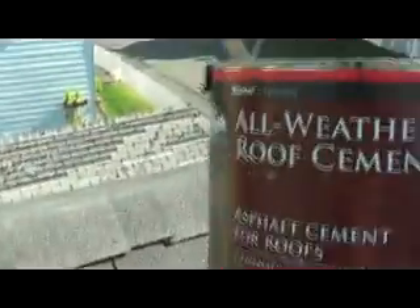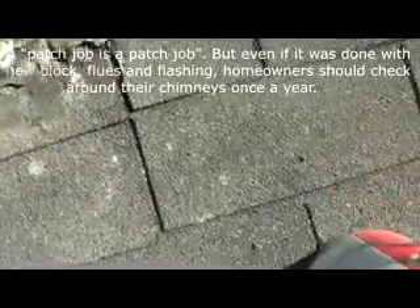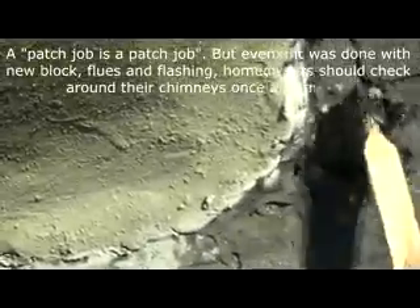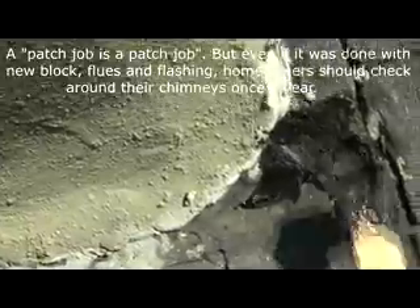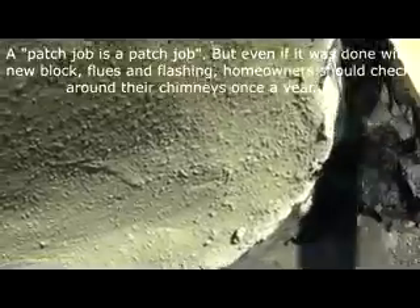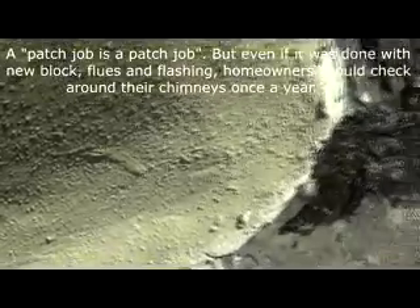Now I brought some tar up and I'm tarring the roof. This is what I'm using — all weather tar, means it goes over wet stuff. I'm not worrying about it looking pretty up here because there ain't going to be any girls dancing with high heels doing the polka. This is just to keep the rain out. It's an old house and we're just going to tar it in real good. Just using a stick — actually a door shim, anything that works.